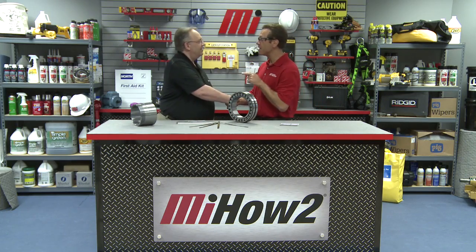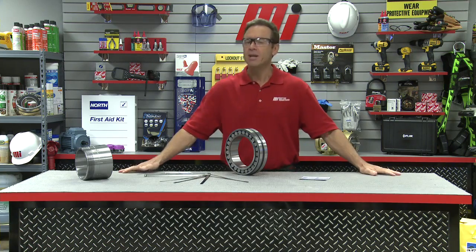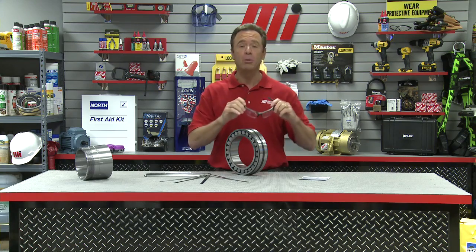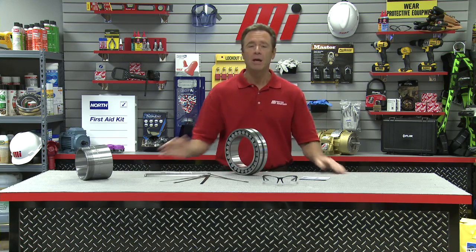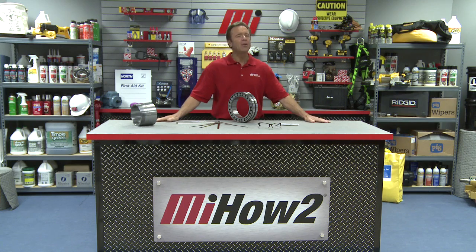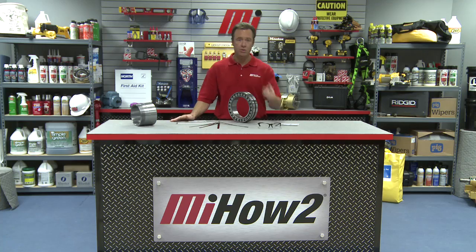When we are at five thousandths of an inch, we know we have properly set the radial internal clearance of our spherical roller bearing. And there you have it — how to measure and set the radial internal clearance on a spherical bearing. If you have any questions about anything you saw here today, contact your nearest Motion Industries branch location. Hopefully this will help you with your practical application. Whatever the job calls for, make sure you're wearing the right personal protective equipment — safety is always number one. Don't forget to look for other Motion Industries how-to videos with me, Tom Clark, as your host. Thanks for watching.